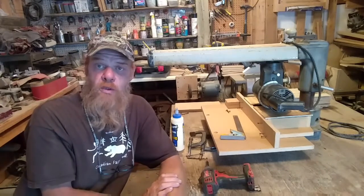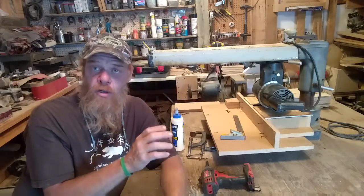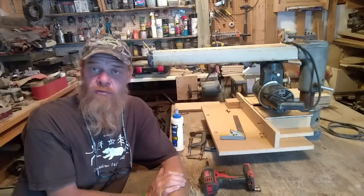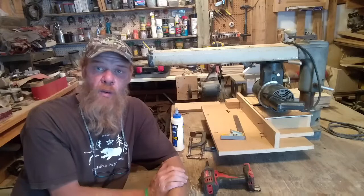So I'm going to show you another way to actually mill up that stock. A better option would be a vertical band saw — a wood cutting band saw — and you can re-saw that stock into thinner but wide planks through whatever application you're going to be using that for. I'm going to show you how I do it.